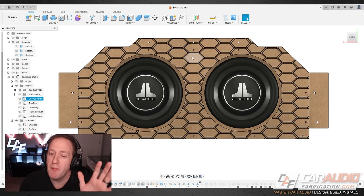On the side pieces I noticed some hard inside corners I wanted to eliminate before exporting any data for CNC. On the back side of the ring I need holes to match up with the inside part for threaded inserts — hiding those and adding the hole feature gives me five holes for threaded inserts. I then added all five threaded inserts to the model. The beauty board needs to mount to those inserts, so I added five 10-24 one-inch-long fasteners. 3D modeling lets me verify the fastener length is not too long to press into material or too short to reach the insert.